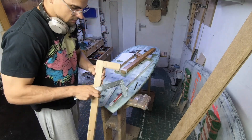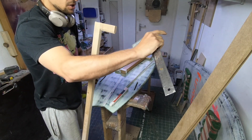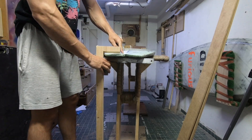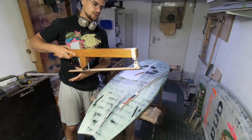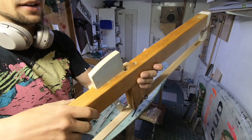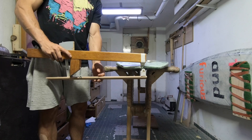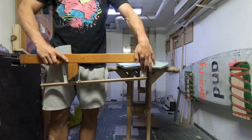Next is the thickness of the board, which sounds simple but is actually quite difficult to measure because the tool is tricky. You could use a giant caliper — it would have to be much longer and reach the middle of the board — but I made a custom tool that looks complicated yet makes the process much easier. It measures the width here and I made a scale on it, which isn't 100% precise but is far more than enough for my purposes. It's really easy to use.